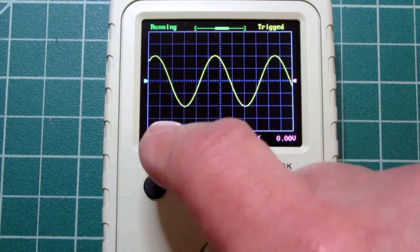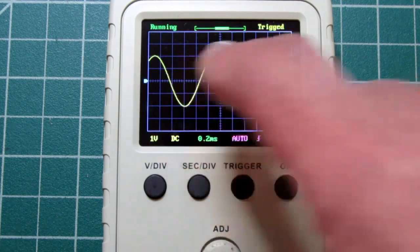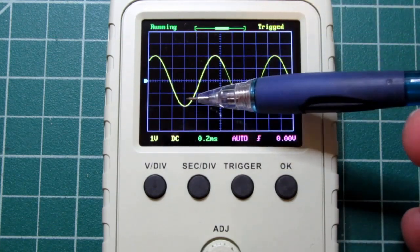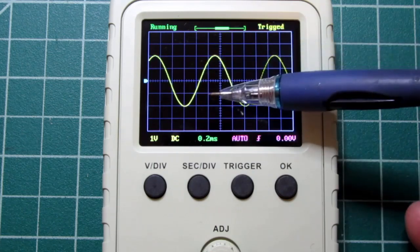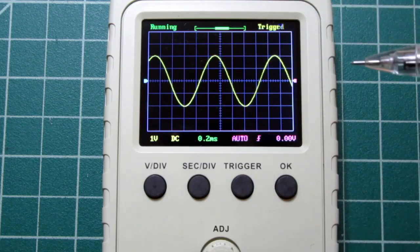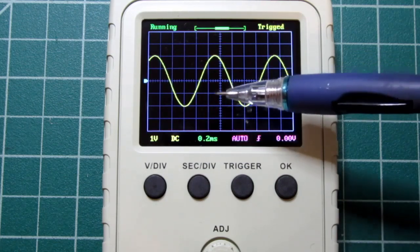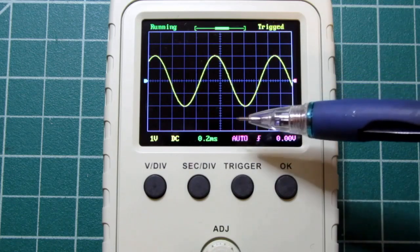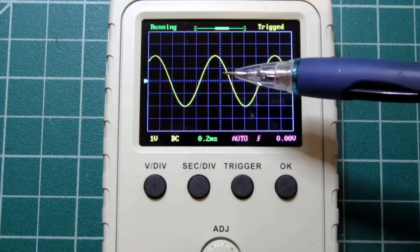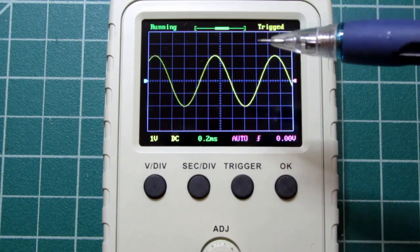So how do we figure this out? Right now I can go from this peak — one, two, three, four divisions from peak to peak. And at one volt per division, that's four volts peak to peak, which is exactly what my signal generator is putting out. So you can use the scope in the normal way to measure voltages, and it's fairly precise. The accuracy is 12-bit, which isn't like a professional scope, but it's perfectly adequate for normal day-to-day measurements of signals.